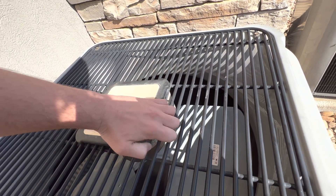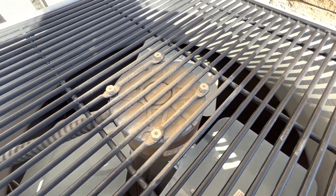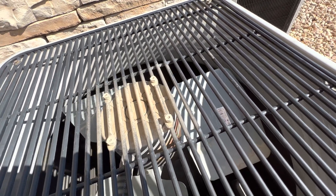If I pull this off, it's basically the top of the condenser fan motor. It's made by GE, which is a pretty good company for a condenser fan motor, and as you can see it is held on by some nuts. Here's the motor itself, which drives the condenser fan. This fan runs at 825 RPM, operates on 240 volts, and is 1/8 horsepower. On the far right is the wiring diagram showing how to wire this up.